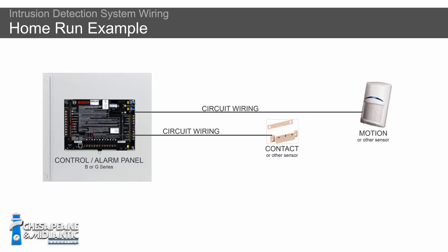I think there are three commonly used wiring configurations. The most commonly used, I think, is the home run. So for home run, you have your control panel and then you have your sensor that's in the field, and your sensor is just wired directly back to the control panel. If you have more sensors than you're able to wire to the control panel — which would be eight — you would need an expansion module, and you can put three of those in the enclosure with the control panel. The general idea is every sensor is just wired directly back to the control panel, quick and easy.